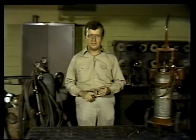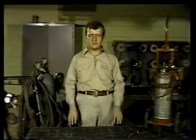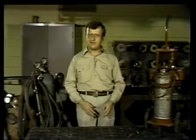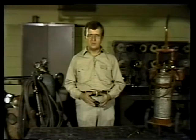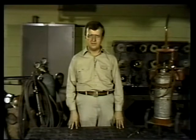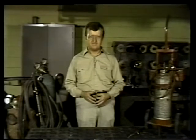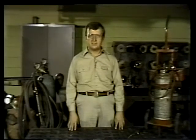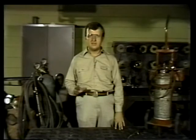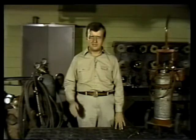When silver brazing, the first step is to clean the base metal surfaces — an emery or crocus cloth is used to remove all dirt, film, and oxidation. The tubing is assembled and the joints to be soldered are heated until red. When the base metal is the right temperature, the silver filler rod is touched to the joint and permitted to melt, flowing into the joint to form a bond. That covers the basic uses of a gas welding unit. A thorough working knowledge of the equipment will only come with experience — so as you assist the welders in your plant, pay attention to how they do their job, as their expertise will be a valuable tool in helping you work with gas welding safely and develop your own skills.